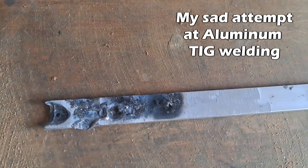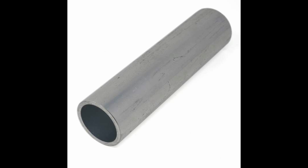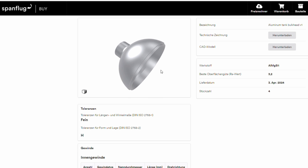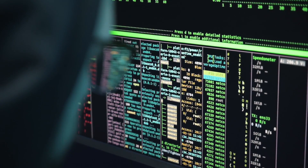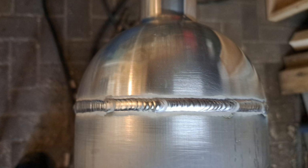Welding aluminum is a bit more tricky, so it can be a bit more difficult to find solutions for how you're going to manage to do it. We decided to start easy: we picked a 3 mm aluminum liner, which is actually quite thick for the job, but this way we can prove out how we're going to weld the whole thing, and maybe in the future iterate to an even thinner-walled tank. We got an aluminum tube in the dimension we wanted, had the bulkheads machined at an external company, and through some sleuthing in the welding community in Bremen we found a welder comfortable with TIG welding our aluminum.